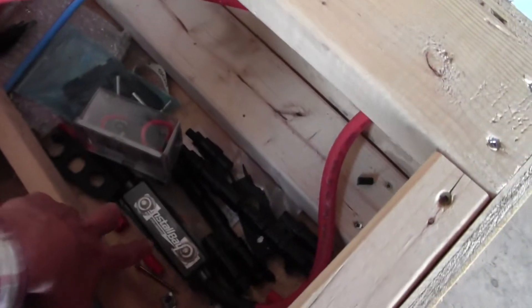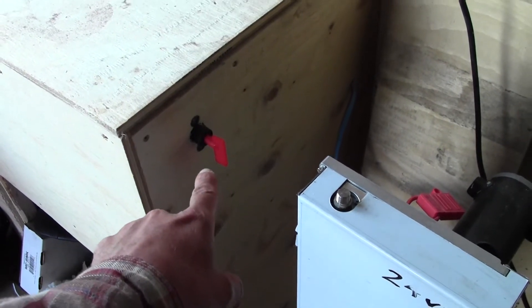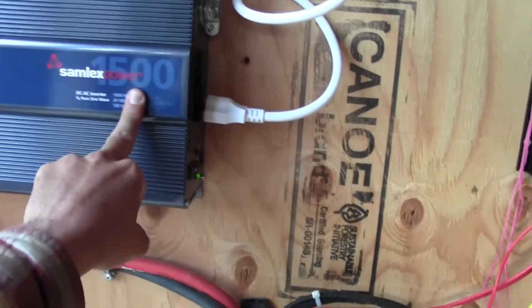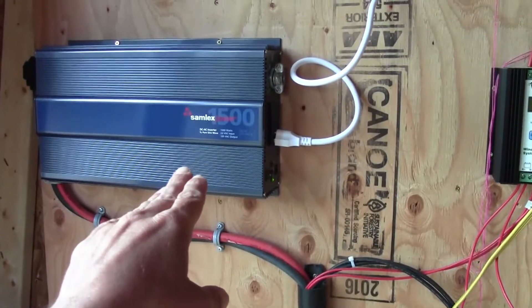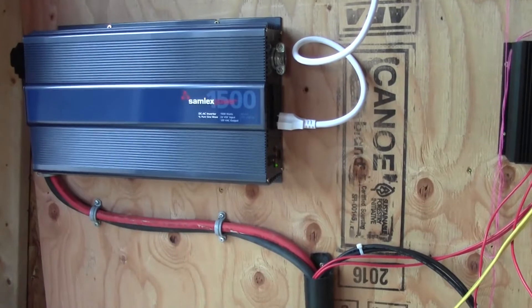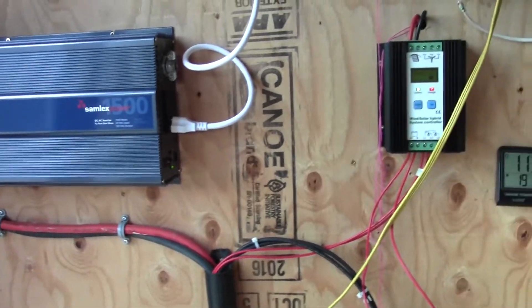Down in here there's another fuse, and that fuse runs to this switch. If you turn that switch, all power to the inverter gets turned off. This inverter is a 1500-watt pure sine wave — the one at the back is 3000 watts. Pure sine wave means you don't have to worry about it ruining your electronics, motors, or anything like that. They're a little bit pricey, but right now it's running a lot. Up at the main part of the house, around the barn — if you've watched our other videos and saw us running power tools, table saws, chop saws — this inverter is actually the one running it all.